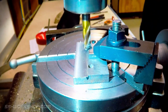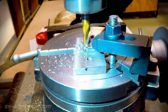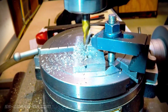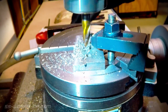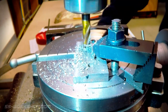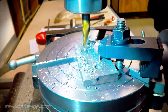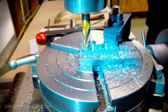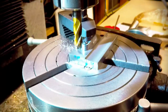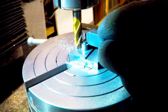The X-axis is then unlocked and the side taper cut. The part is then rotated and ready to cut the other side. At this point the strap clamp is refitted on the other side, then the final cut can be made.